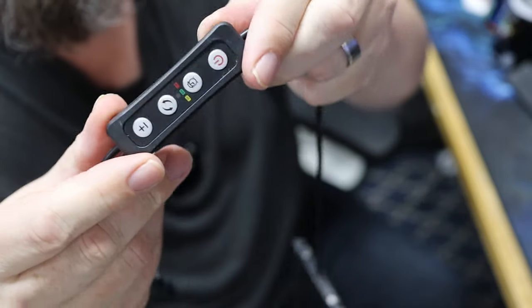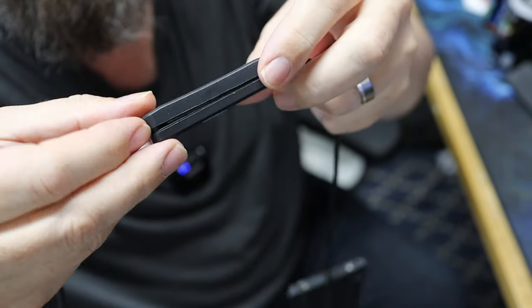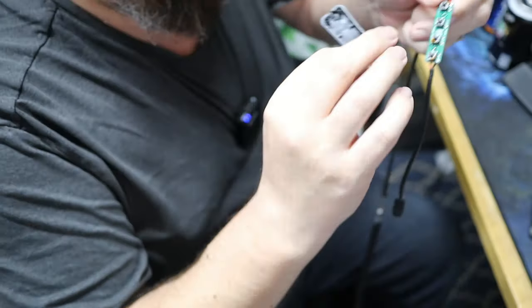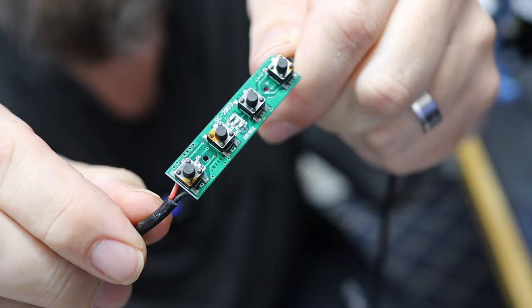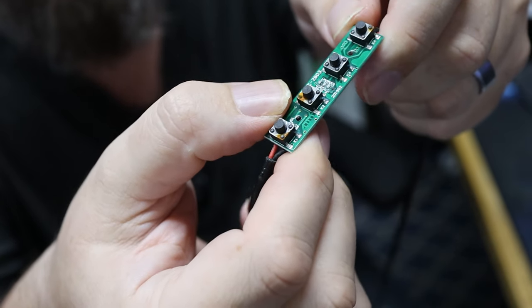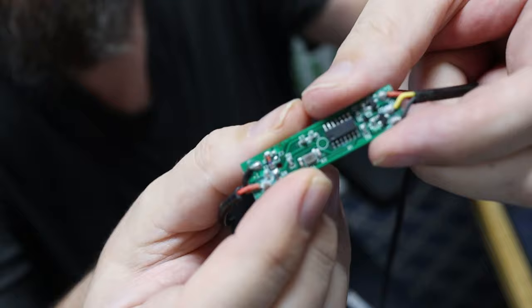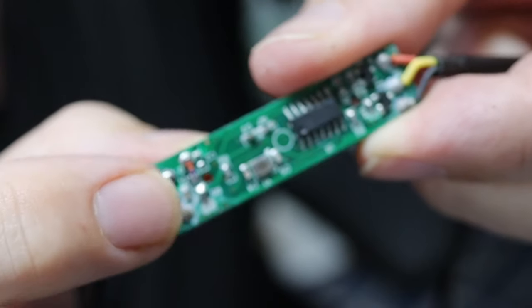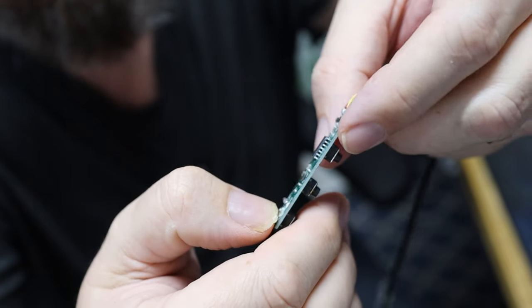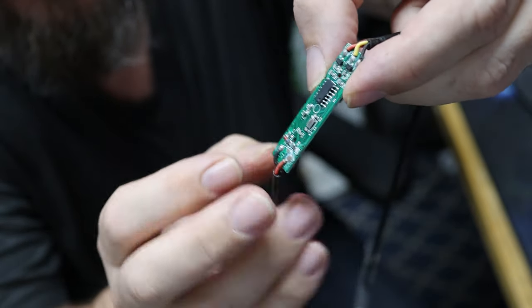The next area might be this bit — I'll call this a control unit. I've already opened this, but basically you get a little spudger or something in there, crack it open and it should come apart fairly easily, trying not to break anything. And in this version you get presented with this — and lo and behold, we have some signs of corrosion. You can see these little rusty parts — they might be blue or green type stuff, it might be brown like this — but you can see a couple of these switches have got rusty bits on them. And if I turn it over, along the contacts here, that again looks a bit suspect — it's gone both rusty and started to oxidise. Anything around here with electronics like that causes short circuits and any temperamental behaviour that you're seeing in the lights.